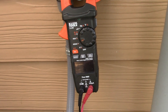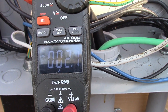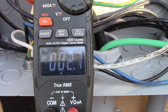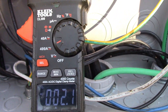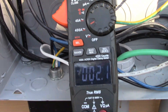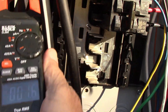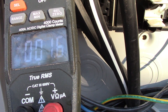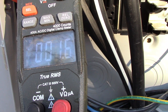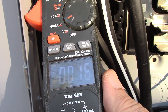That's why I don't have to take my load calculations at 100%. We're currently pulling 1.7 amps; when fully running it will come down to 1.6. I'm going to base my calculations on 1.6. Now let's look at the panel. I have my 240s turned off, so I'm reading one leg only on my 120 circuits — that's reading 2.1 amps. So L1 is pulling 2.1 amps. Let's check L2.